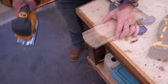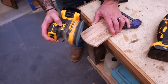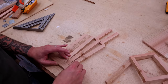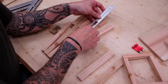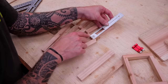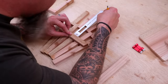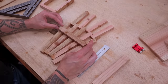Cut the arch out with the jigsaw, then while it's clamped together go ahead and sand it. With the arch cut, fan the boards out — place a square edge on the bottom, keep the center board centered, and arch the tops out three-quarters of an inch, using scrap pieces of three-quarters material for spacing. To get the arch back: from the edge of the center board, drop the two middle boards down a quarter inch, then from the outside edge of the middle boards, drop the outer boards down a quarter inch. Then take the upper back brace — which has 20-degree angles on each end — measure down two and a half inches from the top of the center board, and install the brace. This is a perfect place for a jig if you're making several.